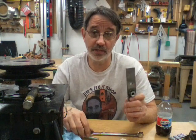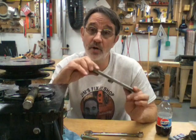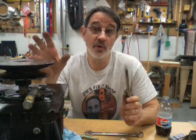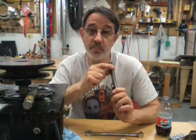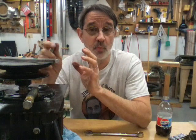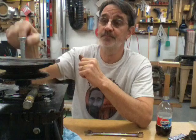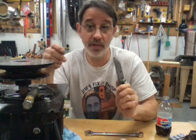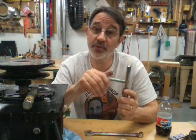You can make this out of just a scrap piece of steel — a four-inch-long piece is plenty long. I used a longer piece because I altered his design to accommodate viewers who don't have a welder. He welded a nut on the bottom of the plate and it fits down inside the drive disc — the weld just keeps the nut from spinning while you tighten the bolt that pushes on the end of the crank. For those of us without a welder, I made it a little longer and put three holes in it — this hole I drilled and tapped does the same purpose.